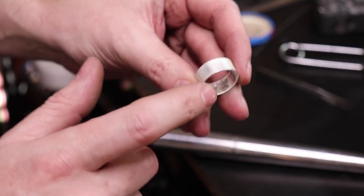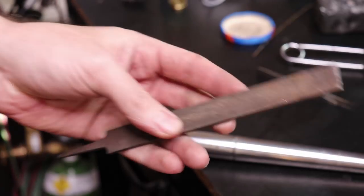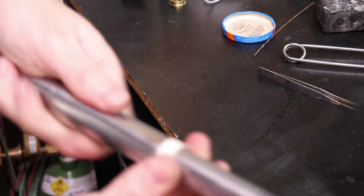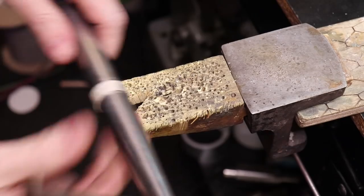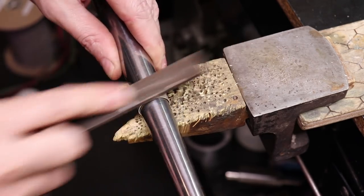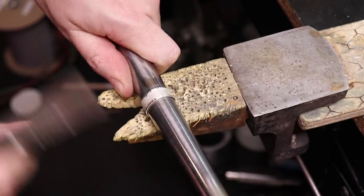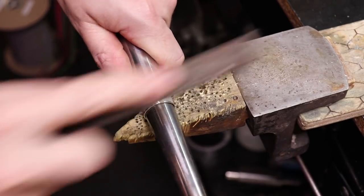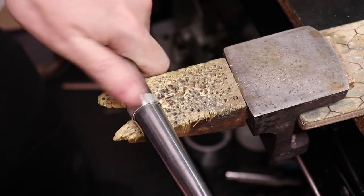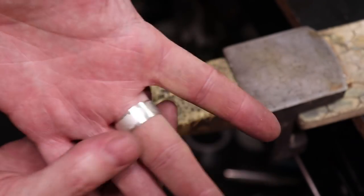What I'm going to do next is take down this weird flare. There are two ways: you can use a hand file and put it onto your mandrel so you have something to hold it with, and just go over it — you'll see you're only making contact with the outside edges. Also, I have the solder joint here that I want to cut down. It's not going to matter too much because this is all going to be covered completely, but I want to make sure it's pretty smooth right there. So the ring fits.